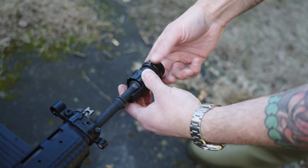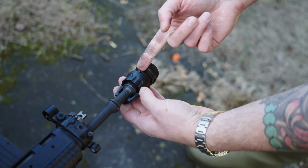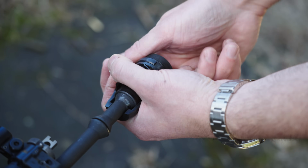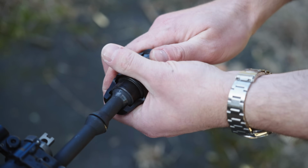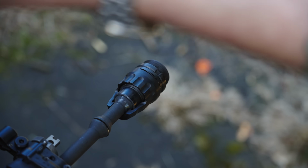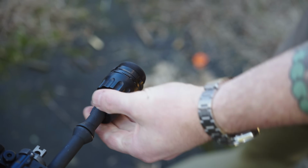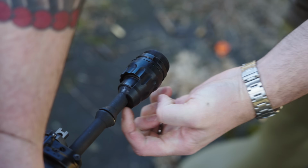And then you keep it static. You screw it in like this. It's got this nice little leaf spring ratchet, which if you're trying to get it loose and break it away, it's quite easy to hold this and break it away the other way. But you want it nice and tight so that this sits on that taper. You can see the polished, circumferential polished mark. So we're really close to being super tight there. This ER25 spanner is not a bad one, but you want to hold the collar and tighten it like that. So now it's locked onto that rear collar. You can still rotate it a little bit by hand, but you can see it's locked on.